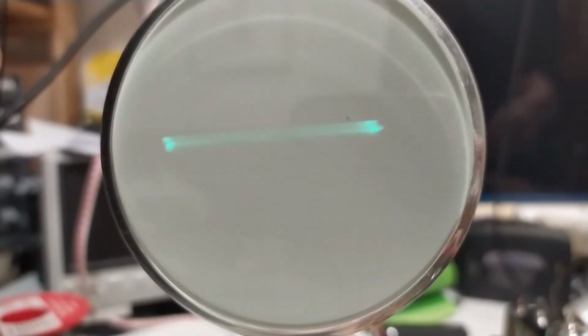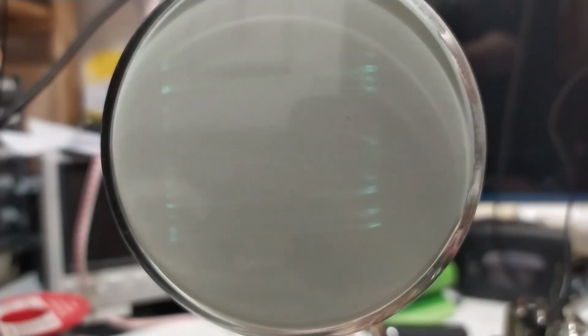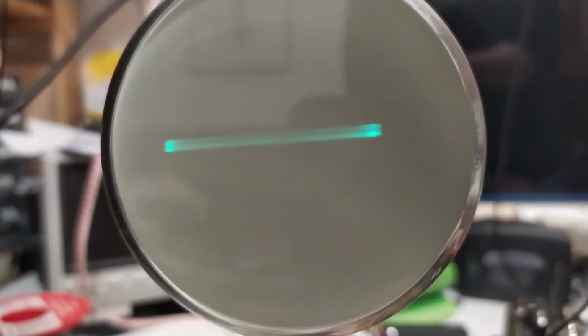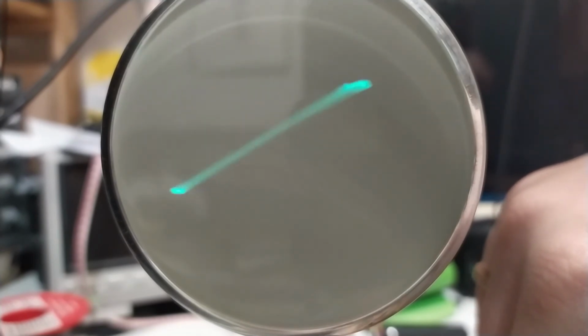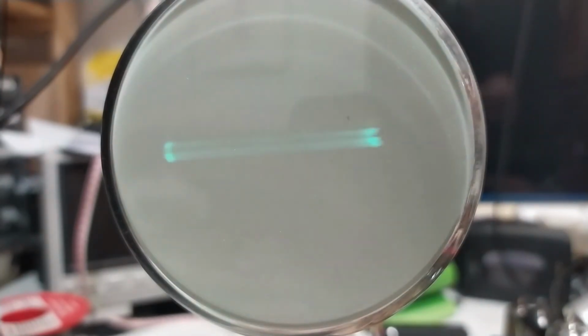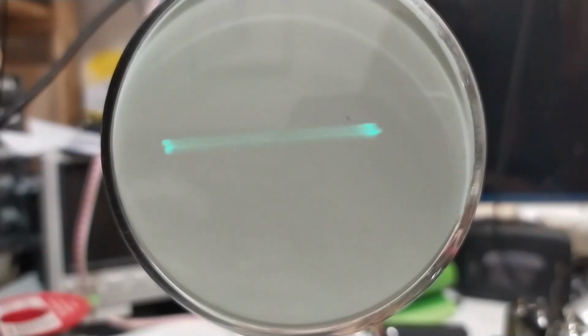But if I actually connect up the vertical channel to the same signal source, so now you can see there's just some noise on there if I touch this. And it's just me coupling in 60 Hz or 50 Hz hum, and it gives this sort of interference pattern. So if I connect this up here, you can see it gives us a diagonal line, which makes perfect sense because now basically a sine wave, but both of them are climbing at the same rate, so we get a diagonal line and it just returns to 0 again.